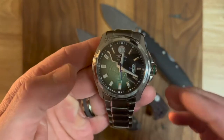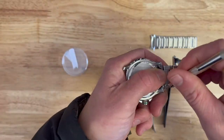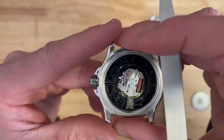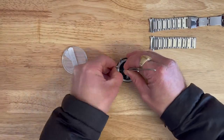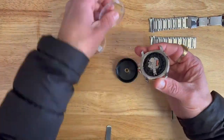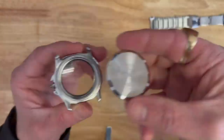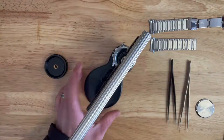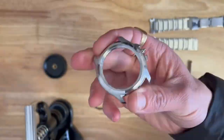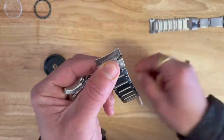I'm going to roll in some footage of me disassembling this so you can see I knew what I was doing in terms of disassembly — I was totally shooting in the dark when it came to the acid wash. Initially I submerged it for five minutes with absolutely no effect, no etching of the steel. I doubled it to ten minutes — still no effect. Then I extended it up to an hour — still absolutely no effect.